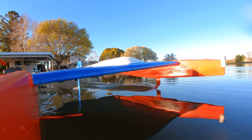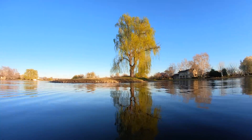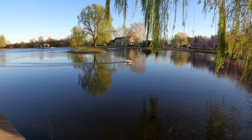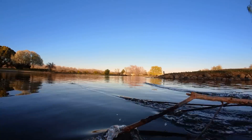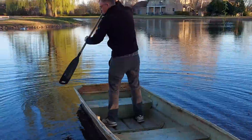It was at the first stop that the ventilating tendency of my hand-shaped surface-piercing foils began to become more apparent. Hand-shaping means you may create an ineffective foil shape as well as introduce surface imperfections, and at these tiny Reynolds numbers those flaws can be critical. Then one of the foils broke off.